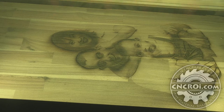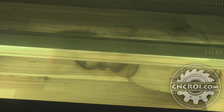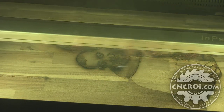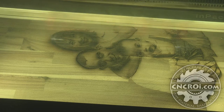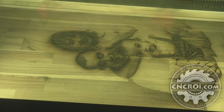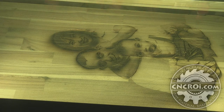If you use too much power when you're actually burning into wood what you end up with is too much charring and you end up losing a lot of resolution in the photograph. The first two photographs were actually done professionally with a white background — I was wearing a white shirt and everybody was basically wearing white so the contrast is just absolutely perfect. The last picture is the one I just took of Simon on the sidewalk outside, and it just happens there's a lot of busy stuff happening but the contrast is good enough so you can see the photograph.